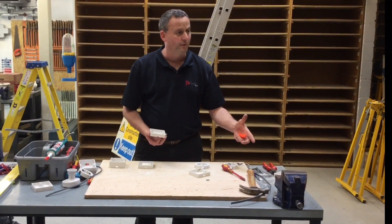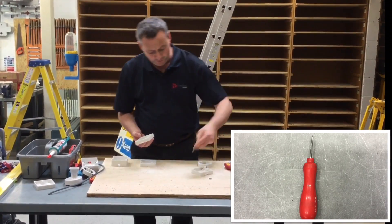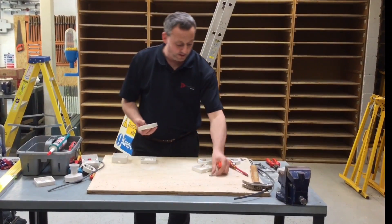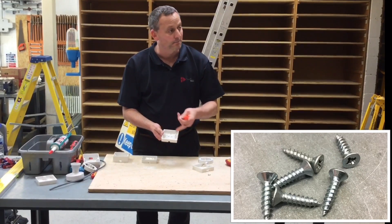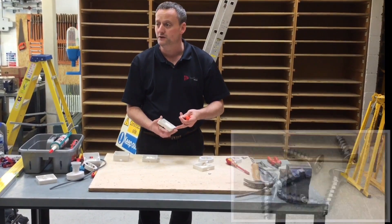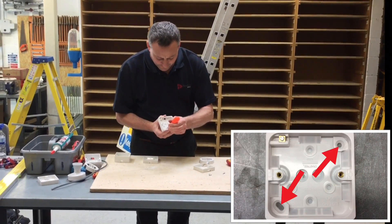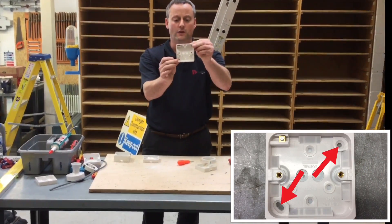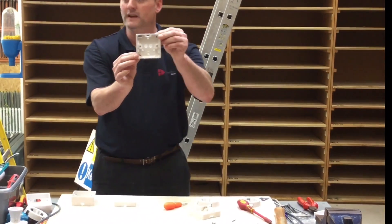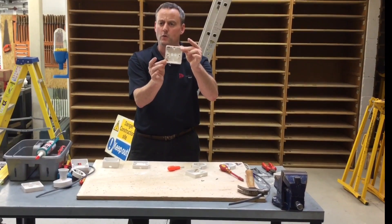For the first fix to the wooden board, I've already got four of my five accessories down. We're going to use the bradawl to make a hole by pushing it against the wood, and we're going to be using three-quarter inch number eight countersunk screws. It's a plastic box with a countersunk recess, so we're using countersunk screws. We're also going to use the two outside fixing points — one of them has a slightly larger screw fixing, giving us the ability to adjust if we don't quite get it level.